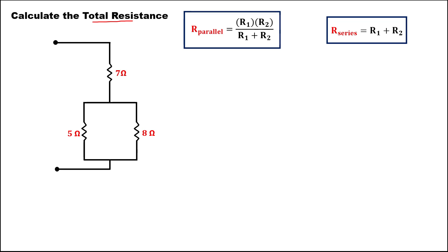For this given, to find the total resistance, I'm going to solve this one in a step-by-step process. First, find the total resistance for these two resistors since this one is a parallel. Using this formula, we have resistance 1, that's 5, times resistance 2, that's 8, then over 5 plus 8. To simplify: 5 times 8 is 40, and 5 plus 8 is 13. Then we have 40 divided by 13, which is equal to 3.08 ohms.